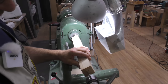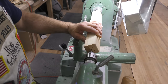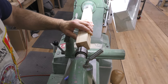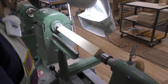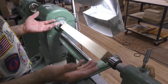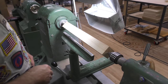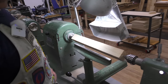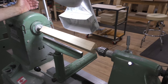I usually just squeeze it in. On this end I'll lock in the ball bearing center — it spins freely. Find that intersection of the two lines and tighten it up, one tight enough to make it safe. You don't want that piece flying away. This is my tool rest — on a large piece like this the longer the rest the better; this one is about 12 inches. This is a General lathe — they're no longer made but it's a good sturdy lathe. For spindle work, the heavier the lathe the more stable it is with less vibration.